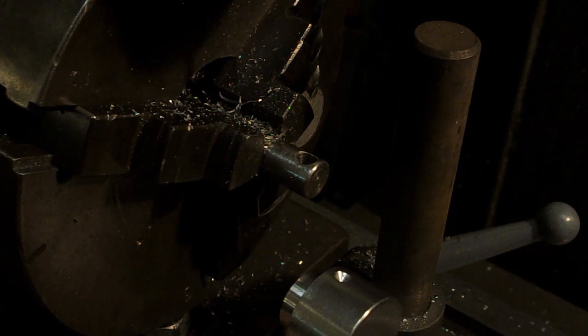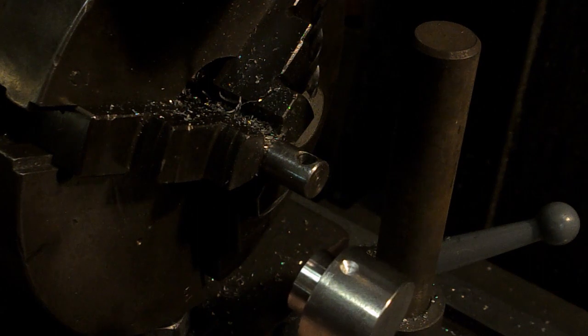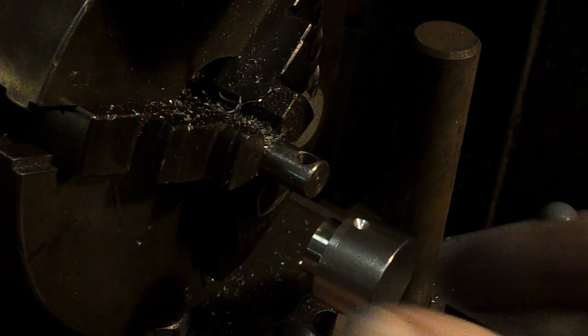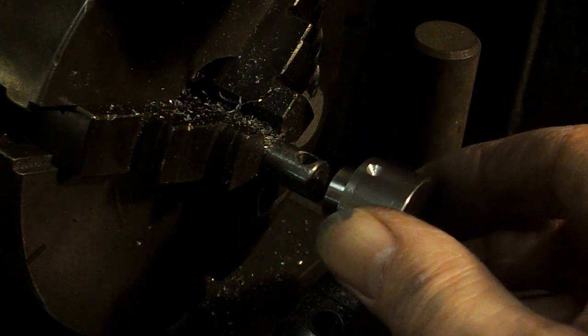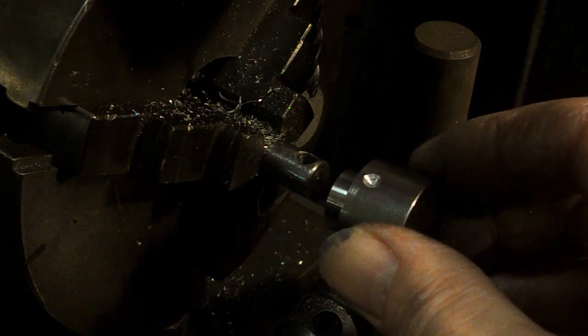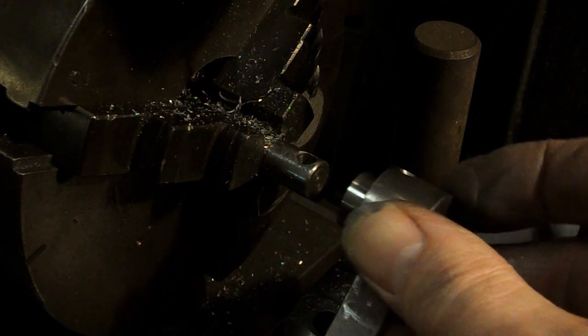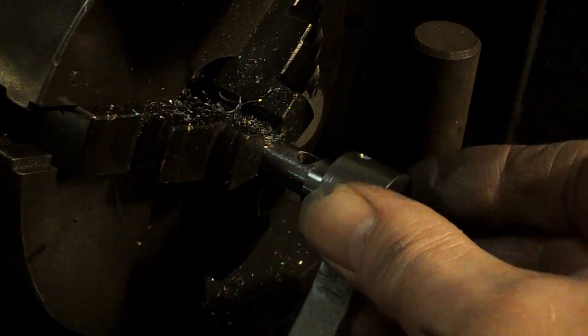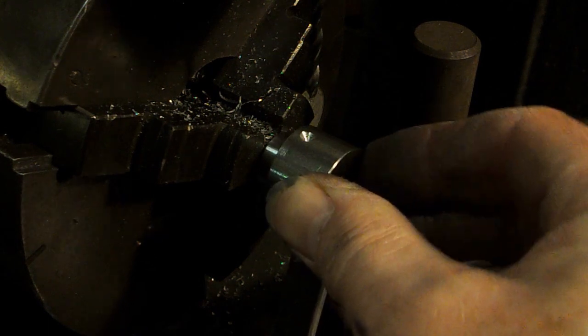Yeah, I'd got those mixed up. Some of the ones which had been done with the small centre drill were, yeah, you could feel the difference. It's really not a good idea to have your drill opening up a slightly smaller hole. Chatter starts kicking in. It's not going to matter with this, but no, not ideal. And we're now on to the ones which were just done with the spotting drill.